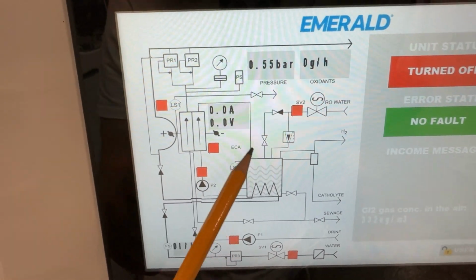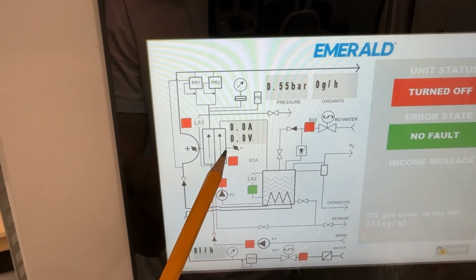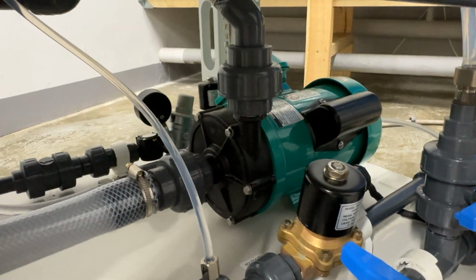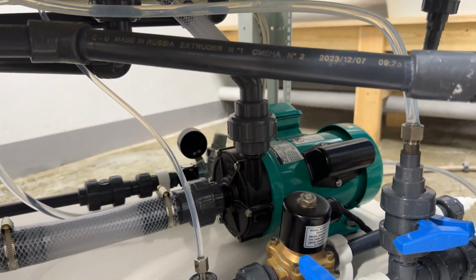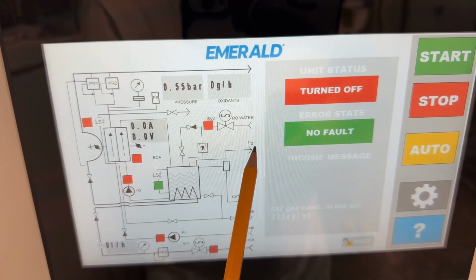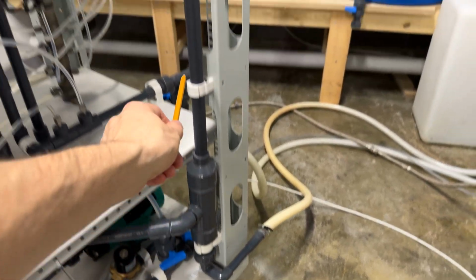We have a catalyst inside this tank, this one, and we have a circulating pump which circulates this caustic soda solution through cathode chamber, just circulation. This pump, the green one. So it takes caustic from the tank and puts it to electrochemical blocks, to cathode chamber, circulation. In cathode chamber, we have a synthesis of hydrogen. That is why we have two outlet lines of hydrogen, which I showed at the beginning. The first line of hydrogen and the second line, where catalyst goes out and the hydrogen is separated.